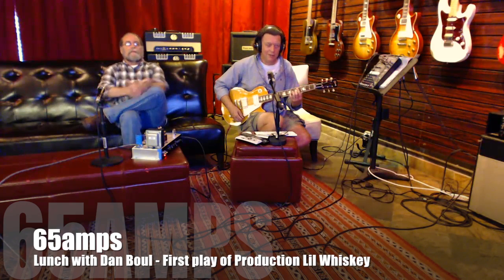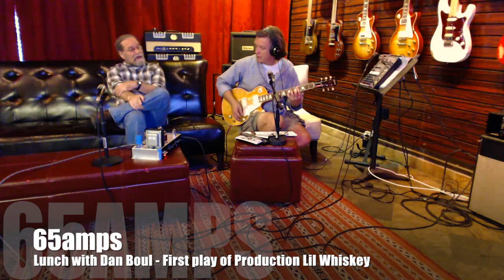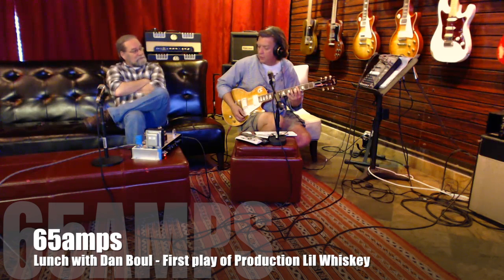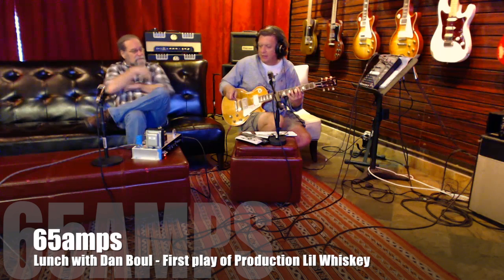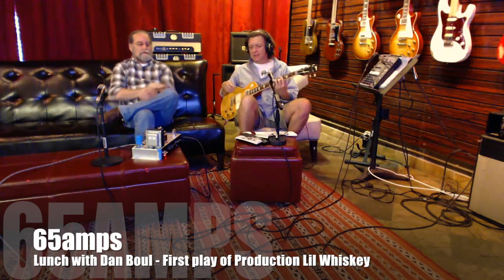All right, Hoss, did you do one of these by any chance with grid bias? Yeah, you know, we try it both ways. The cathode works better on this one. With grid bias, on this particular one, it got a little bit literal. It got a little bit where it sounded like it was verging on pedal. You know, it lost its elasticity.